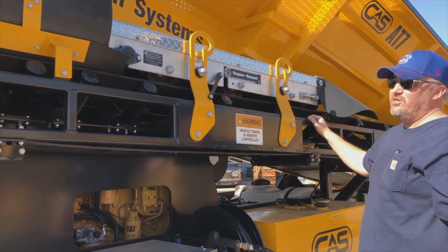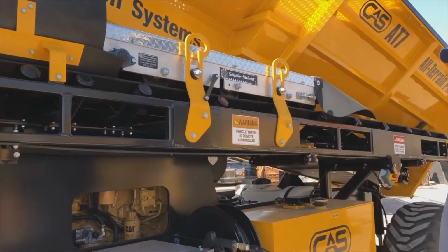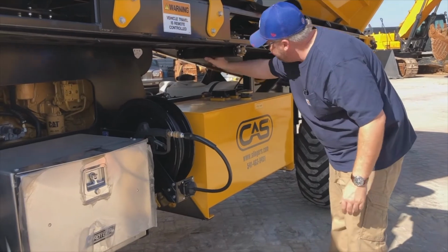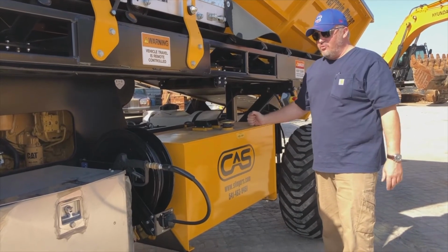But again, we should be checking it, along with any of our rollers, just making sure that our V-rollers are all in good condition, and there's no damage to anything along here. Our return rollers at the bottom, is everything okay with them? Are they running?